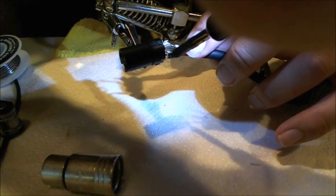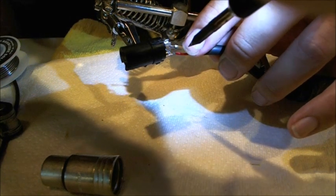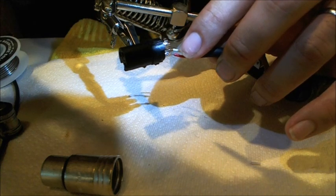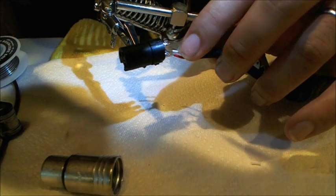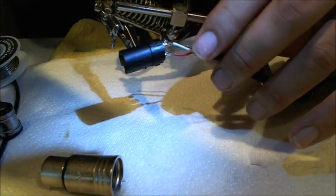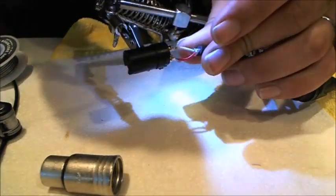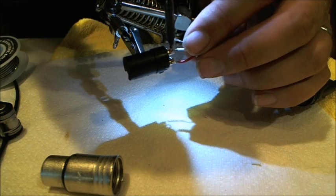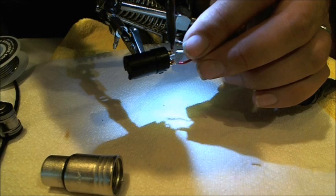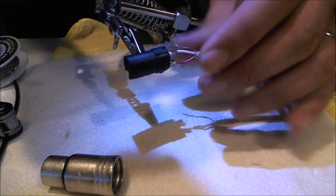Well, technically, just touching the lug should heat it up enough, and it did, to melt it. For that solder to crawl down that wire, that means it's all good and melted all along it. Hold it for a long time until it dries, and we're good. Perfect. That one went perfectly. Let's do number two. That's actually lug number three. Good and melted. That's actually going quite easily.